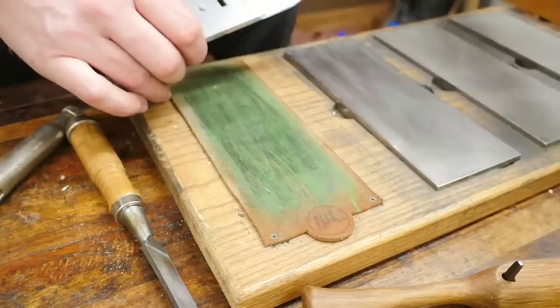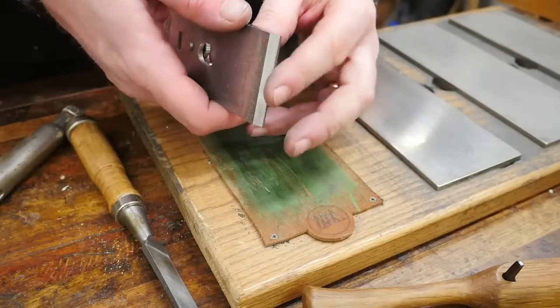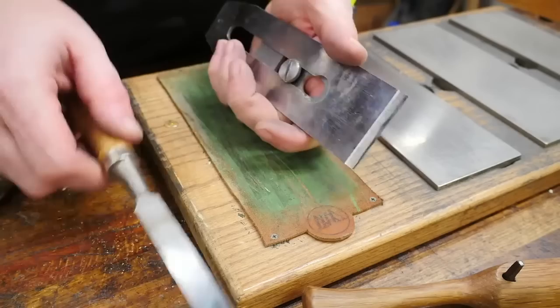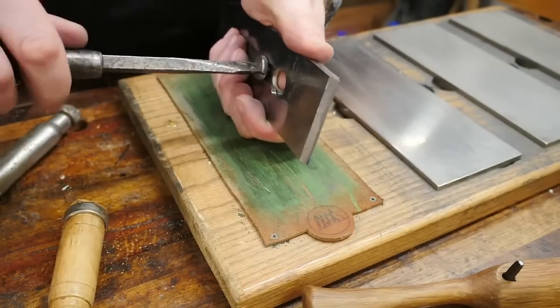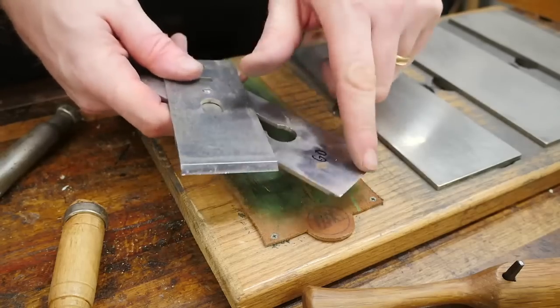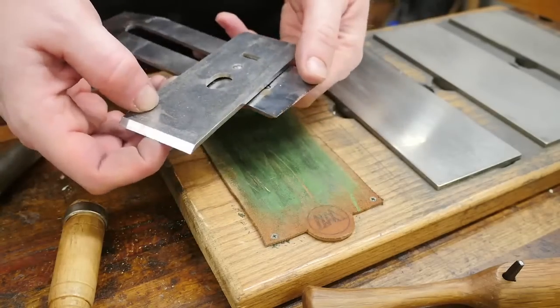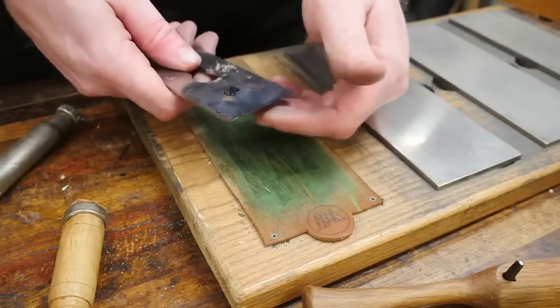And then take it apart, pull this out. Let's see, how sharp are we? Nope, you need a lot of work. So we're gonna take it all the way apart. Oop, not the chisel. Loosen that, back it up, rotate it so that the tip of this doesn't touch the tip of that. Swing it back, and there we have our iron.